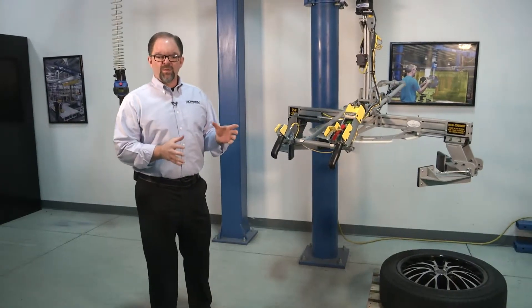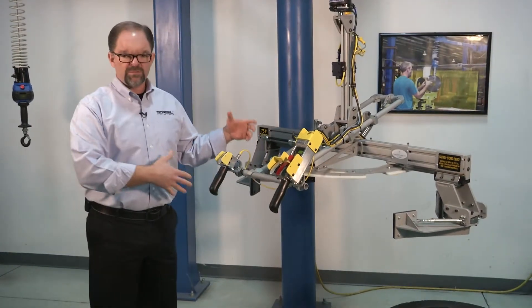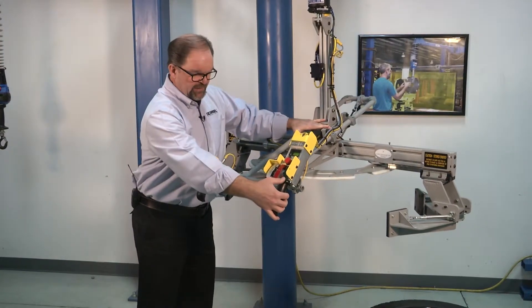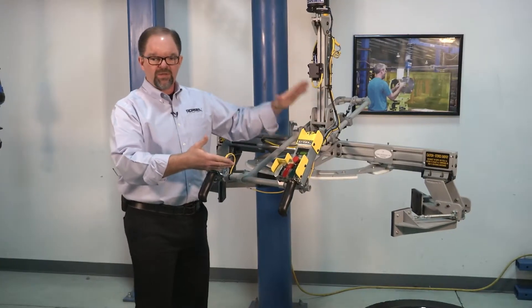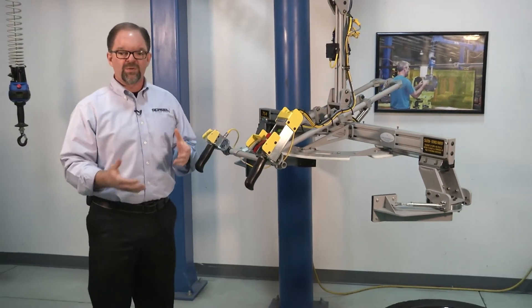So now let's take a look at what we just accomplished. If I go up and down normally with this end effector tool or this load, no problem. But because we set the capacity overload, if I simulate an overloaded condition by pressing down with my hand and try to lift, I will now go into a warning lift condition. If I take that load back off, it will now reset, and as long as that condition does not reoccur, we're good to go.